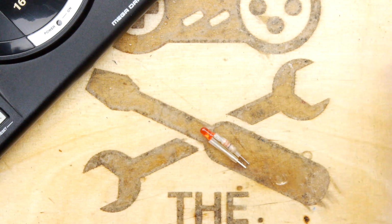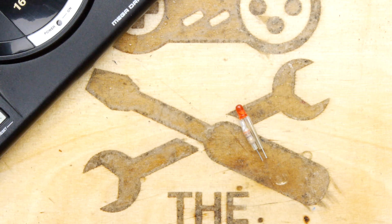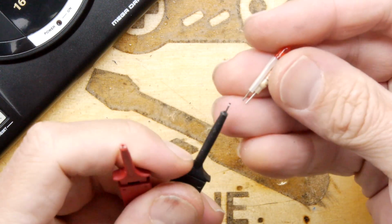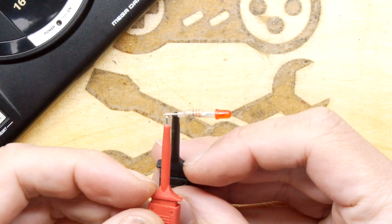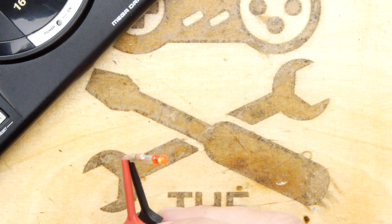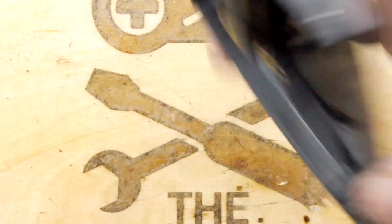But while we're waiting, why don't we try to hook up some power to this and see what it will look like. So I've got some hookup wires here, and I'm just turning my power supply down. It was on 12 volts. That would have blown the LED out. So we know that the resistor leg is our positive leg. Just like that. We'll turn it on. Ooh, nice. Oh, that's nice and bright.